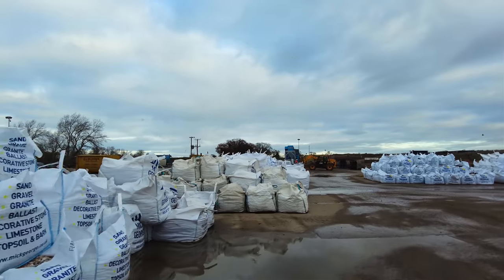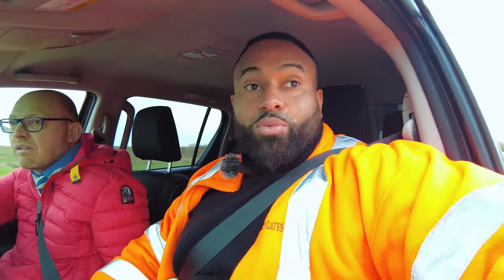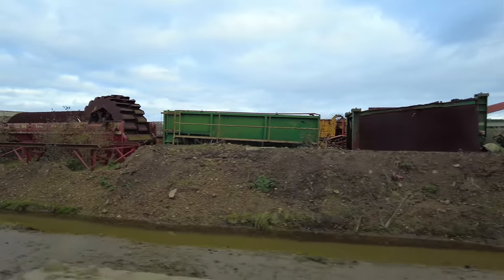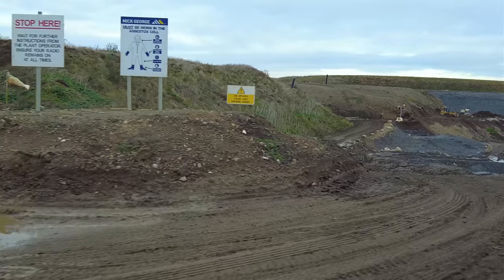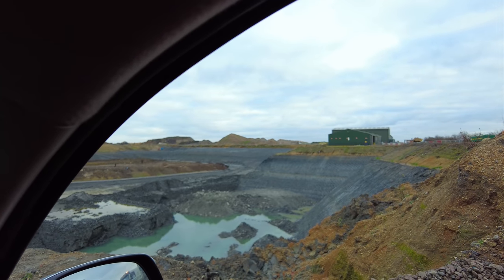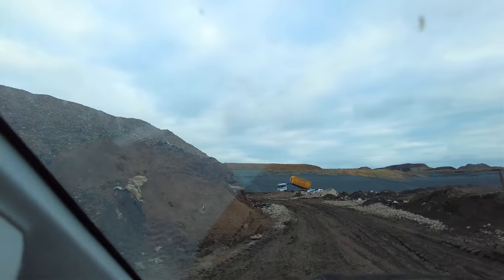This is a lot of bags. Mick George have been on this site for 20 years and they're going to be here for many years more. There's about five metres of sand and gravel which has got to come out, and that means they've got space to backfill with clean inert. Hundreds of acres — look at all this kit. They've got a graveyard of equipment, but there's always bits in there that you can find, reuse and cobble together. They've got 50 metres of clay here, and because of that it actually protects the water beneath. So you've got enough of a void that you can put asbestos in so it will not contaminate water. Clay is basically impermeable material, and they engineer the site to make sure everything is contained — all the leachate, all the waste, all the gas — and it's a safe environment to deposit hazardous materials.